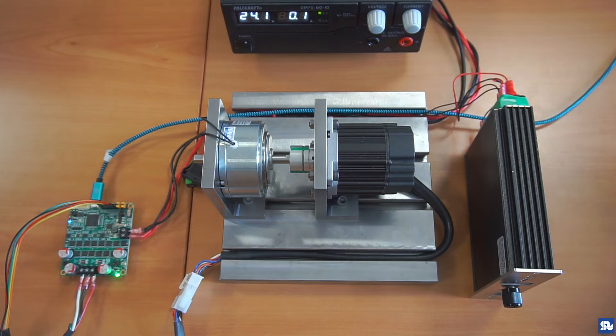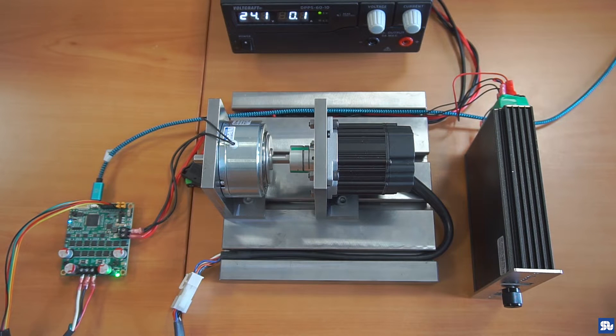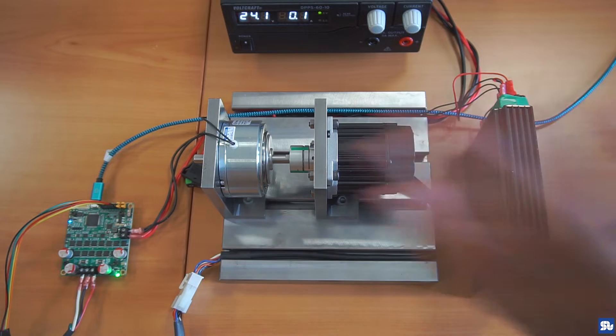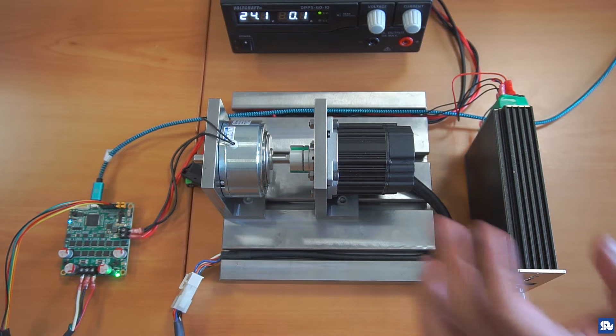Hi, welcome to our channel. Today in this video I'm going to show you first of all how you can control the speed of your brushless motor using SOLO mini — the mini version 2. We're going to talk about how speed controlling works under load, the effect of various gains of the speed controller in field-oriented control like KP and KI, and then the effect of those gains on system behavior and how variation of load affects it. In my setup I have a permanent magnet synchronous motor, a hysteresis brake, and SOLO mini v2.